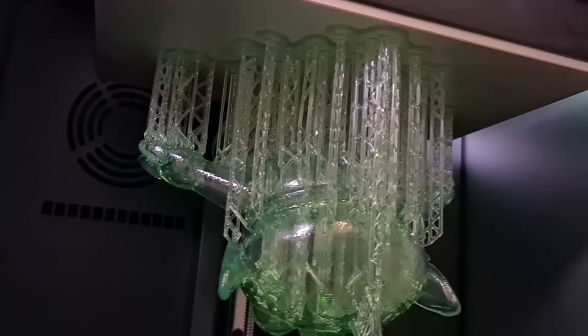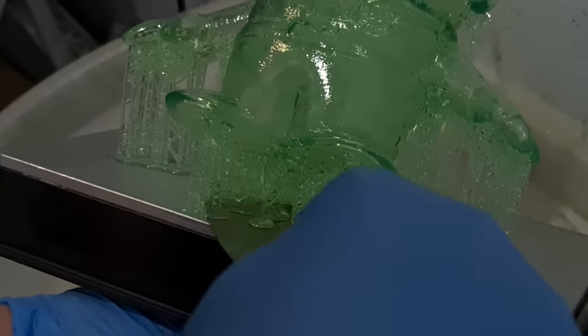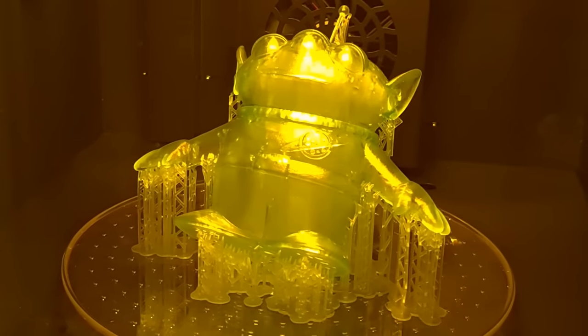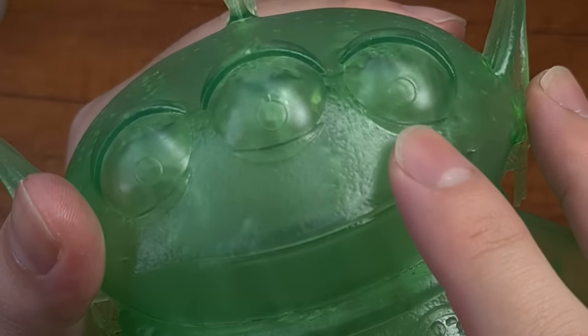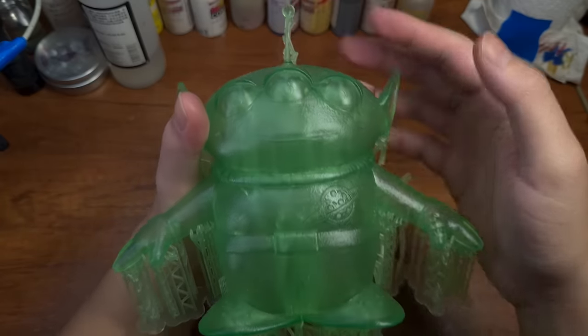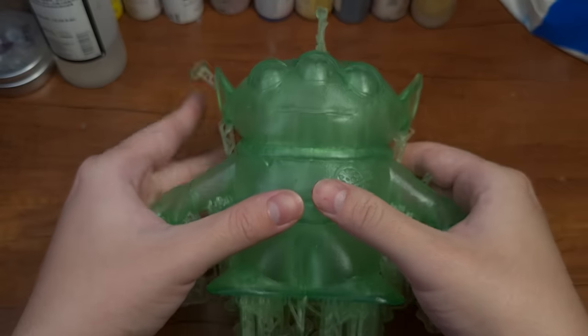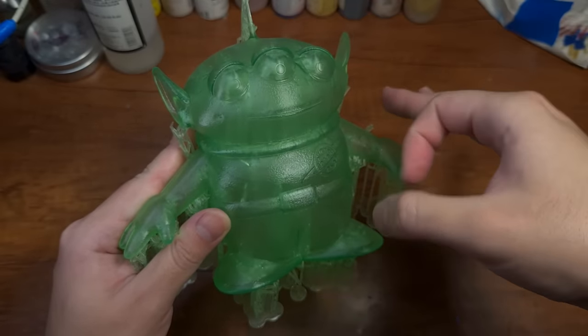After about 14 hours, the print came out perfect. I love the transparent grain of this resin — good adhesion on the build plate but also really easy print removal. Look at the super details you can achieve with this printer: the sharp logo came out nicely, the irises are great, mouth is great, and the antenna is actually flexible. However, I cannot squeeze it at all, which is puzzling because the exposure test is flexible but this print is as hard as a rock. Maybe it's too thick?